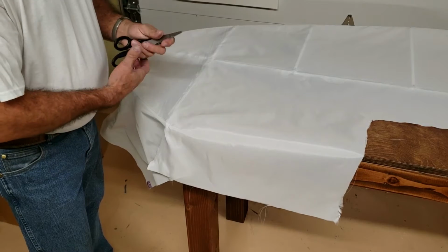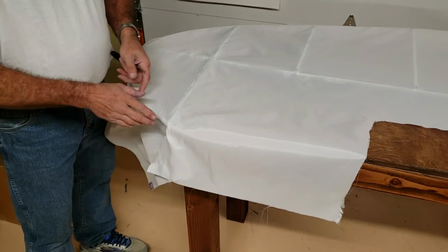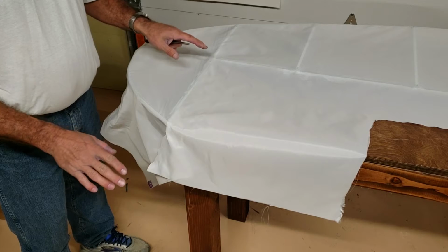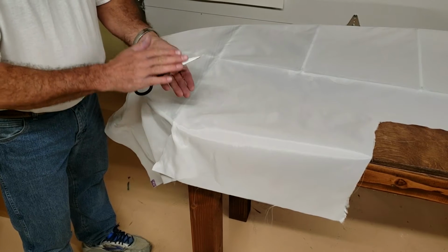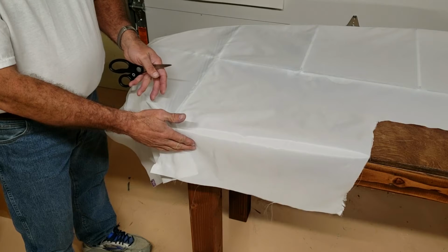And sometimes you'll be trying to glue these parts down. You put glue on it, and it'll stand back up. You put glue on it, and the more glue, and the wetter you get it, the worse it gets, and you just keep fighting it. Sometimes you have to walk off from it. Let the reducer kind of thin out of it a little bit, and at some point it's going to go from too wet to now it's the right consistency of glue, and it'll stick down.